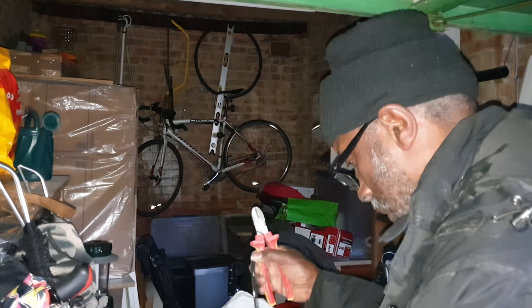Because you've connected the earth down the bottom. No, I'm not connected. That's one of the earths. Well, that's the earth from the box to the... Yeah, that's testing the pyro. So that means the pyro's earth is down there. Yeah. So now it's connected into a metal box. Yeah. So the earth to the metal box, which then completes it. So the cable they took from the fuse board should be connected to that metal box. Yeah. Right. Okay. I'm so pleased, man. Just get this in. I brought a box to make it off into, and then you can run your cable from that box up into our swap switch.